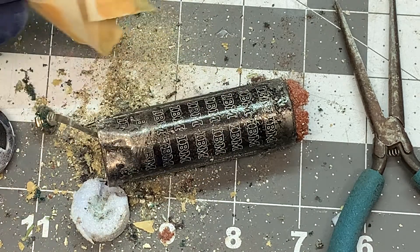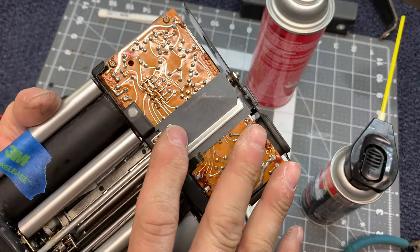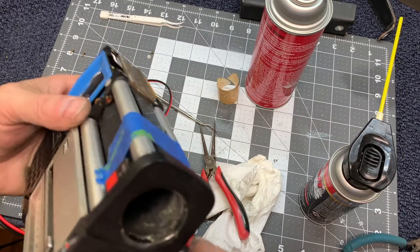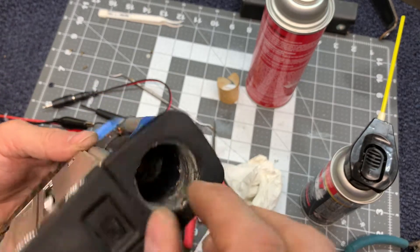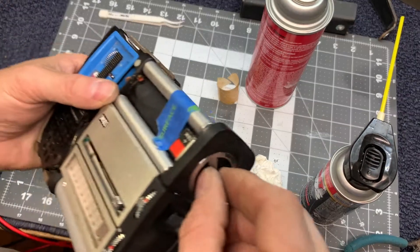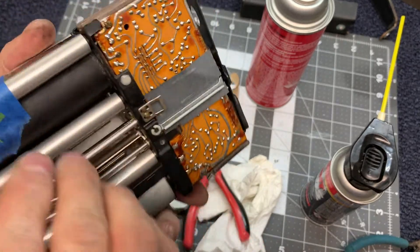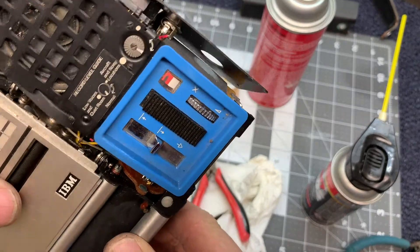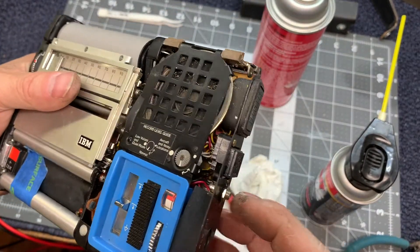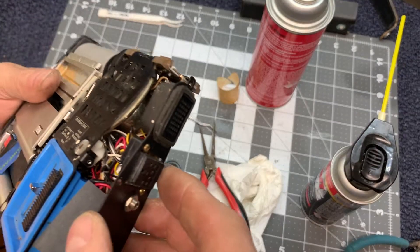And the service ticket — let me get this mess cleaned up and I'll be back. I pulled the whole thing out and got some of the battery compartment cleaned up. You can see there's still quite a bit of corrosion there, and I buffed this rim so that the cover fits back in okay. It snaps back in place — it's a little loose but there's no battery in there to hold it snug. I can't get it powered up. I've checked the battery connector here, the external power connector, to make sure I had the polarity correct, and I believe that's set correctly.